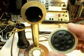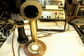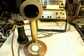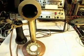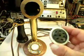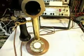Although they can have some problems with the wires and the connections, a lot of times it is just the transmitter capsule and the carbon crystals. That's basically what will cause that static. So if you hear it, that's normal — they all do it a little bit, most of them. Some of them won't, just depends, but it shouldn't be too much to where it's going to really interfere with anything. You basically have to put up with it or go through about a hundred of these until you can get one that's quiet.